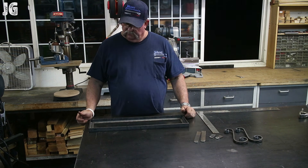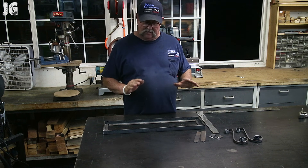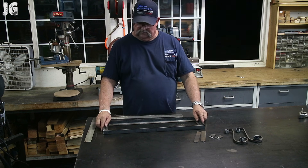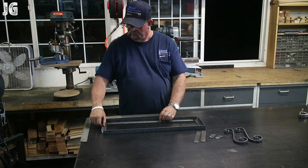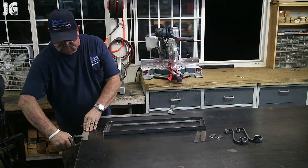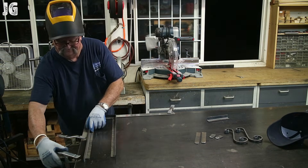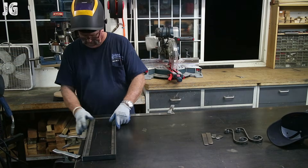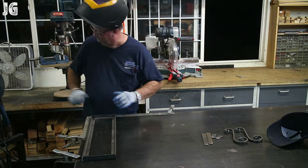Fits pretty good. We'll get things welded out and put together. One little trick — I've never done it before, but as I was sitting here I thought about it. We've got these corners that need to be welded perfectly square. I thought maybe if I just take my square, clamp it to the table, run these things into the corners, flip them around and be sure everything is nice and square — it's a quick and easy way to do it. I'm just starting to assemble the frame for the shelf, tacking all four corners to keep everything square before welding everything out.